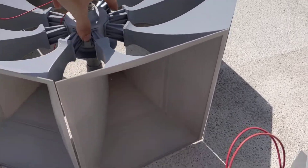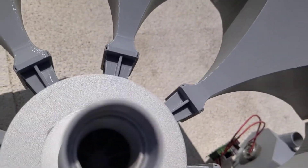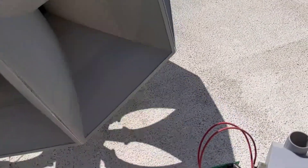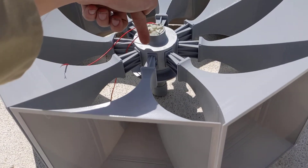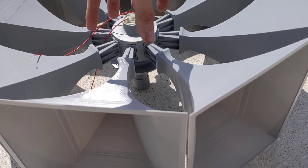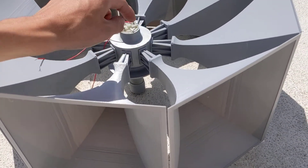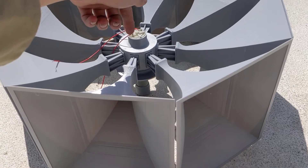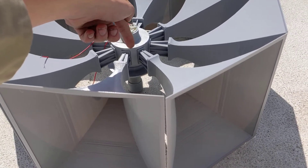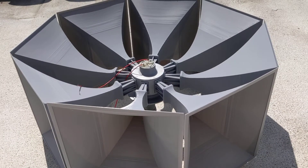Certainly you hear it a lot more without the horns on it. But there's an internal diffuser inside of the siren, which is there to diffuse the air path as it's coming in. Down inside there is a diffuser that's got eight segments — there are walls about right here on the internal structure. The rotor sits in between the diffuser and the stator, and since these walls are offset, the rotor chops against the internal walls of the diffuser. You also get the effect of it chopping against the actual edge of the stator, so you get almost like a 16-port kind of sound, but it's very, very muffled and not dominant by any means.